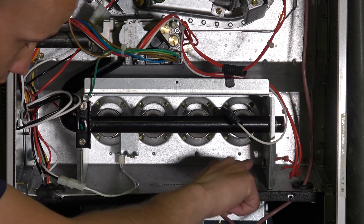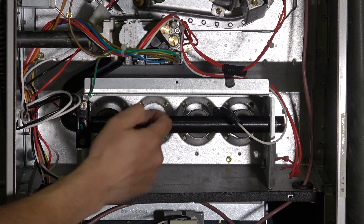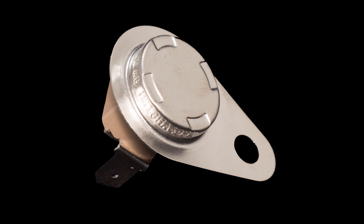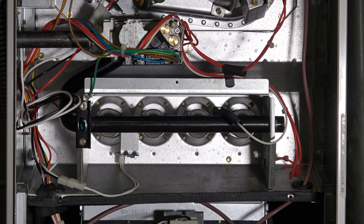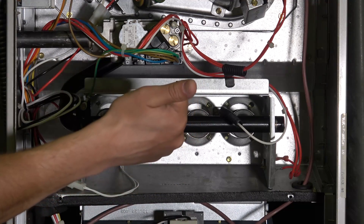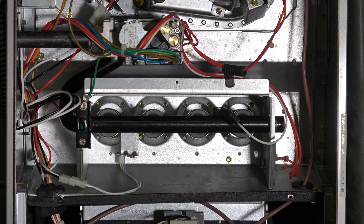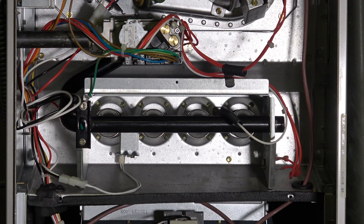We have rollout switches — one on the right side and one on the left side, and sometimes on top or bottom of the burner area. They're on the front side of the burner where there would not normally be any combustion happening. If there's a problem where the heat exchanger is plugged and flames cannot shoot into it, they'd burn and come back out. Those rollout switches detect that high temperature of the rolling-out flame and shut the system down.